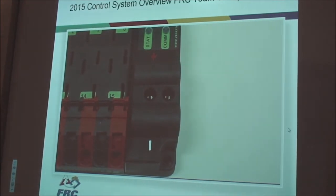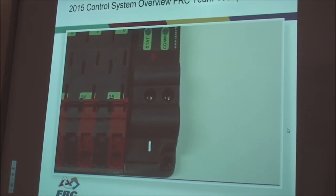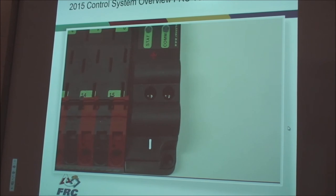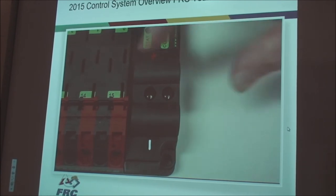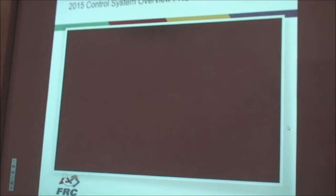Battery power input is very similar to the screw terminals used last year, but there are a few things to note. There is a cover over the terminals to prevent swarf and other problems that arise from bare battery connectors. Make sure not to lose this cover. The small screws on the terminal cover are imperial, requiring a 5/64 key, while the larger ones underneath are metric, requiring a 5mm key.